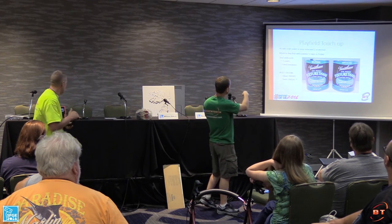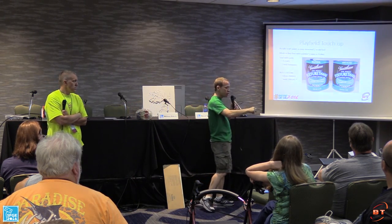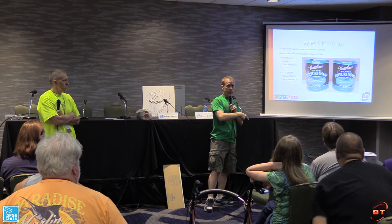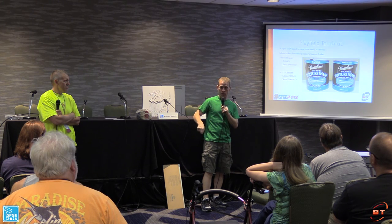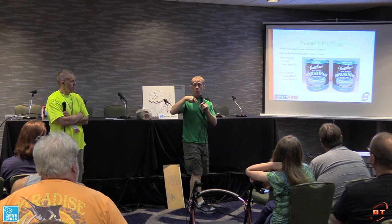So, all right, once you've got your touch-up done, you've got to seal it, because those craft paints are not very strong. If you make a mistake, you can take some mineral spirits or naphtha, and I use naphtha. You can just wipe it right off the play field. It won't hurt the play field. Test it somewhere before you go. Brent Griffin said it won't hurt the play field. Test it somewhere like some of the art, the sample registry art under the apron that nobody sees, but you can wipe it off. The ball will just beat it to death, and it won't last for a few games.